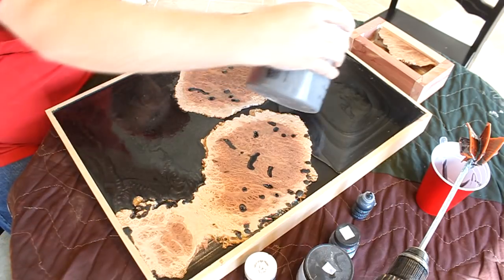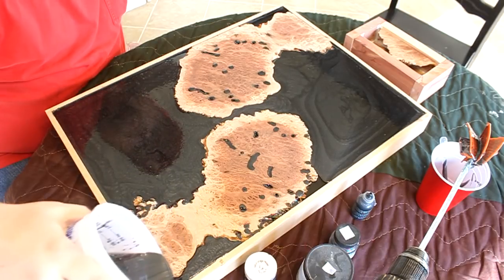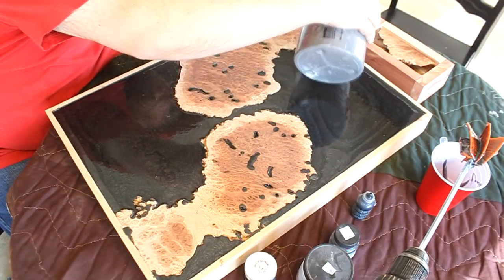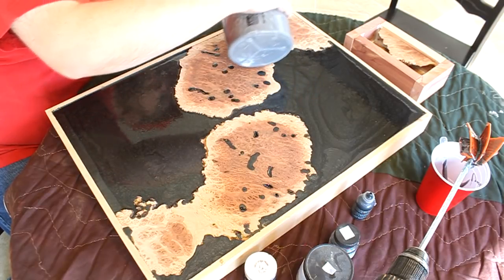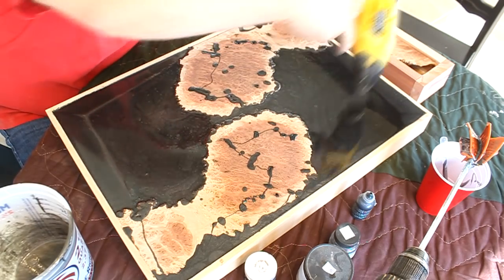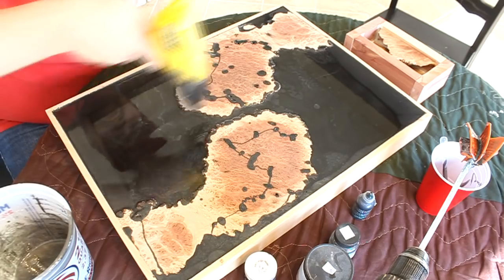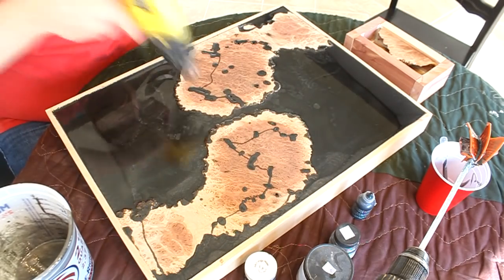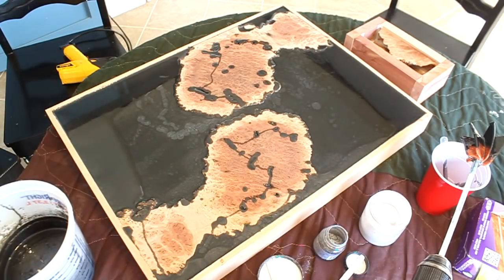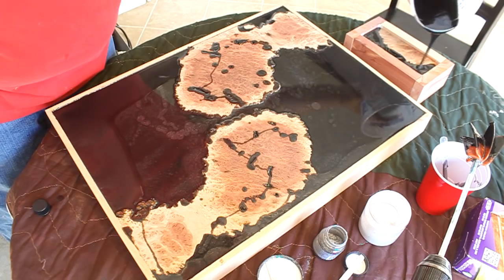It's not very thick - maybe only a quarter inch thick but there's a lot of surface area to cover. You can see in the back I have the mold that I made for the handle which I'll turn later. Doing resin like this you'll need to use a heat gun. This will help the resin flow better, get it up to temperature, and it's what makes it cure - getting hot. It's also going to remove all your air bubbles so you get a nice smooth finish. Here I am mixing up my second batch of resin - I added some to the top of the table but I also added it to the handle which I'll turn shortly.